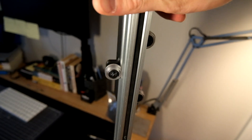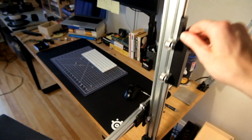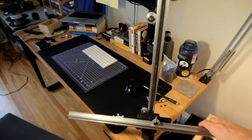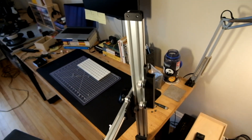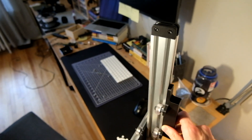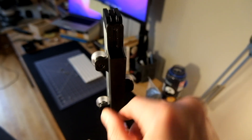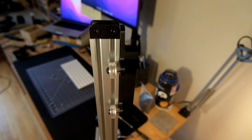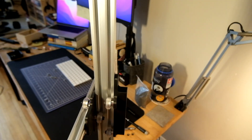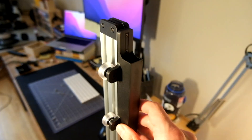That's awesome. Now I have the super low profile nylock nuts on the counterweight, and I want to show you this because now it works perfectly. It slides around, doesn't interfere — this feels really, really good. I don't even have the weights in here yet and it already feels so much better than the previous version. I do think there's probably a redesign in order for these tabs just to pull the ends of the screws away from the carriage so there's really no chance of them ever colliding, but for right now I've solved the problem so I'm going to come back to that and stay with this for now.